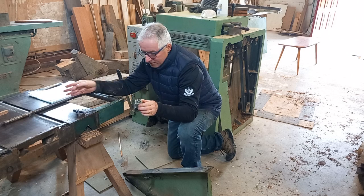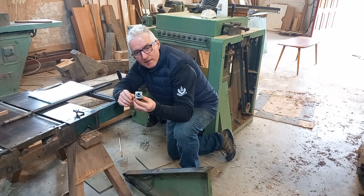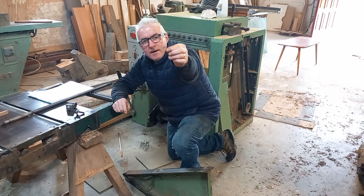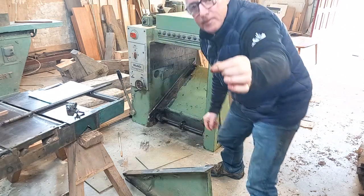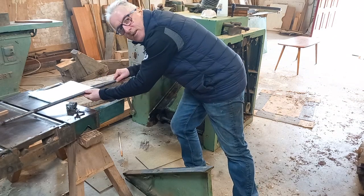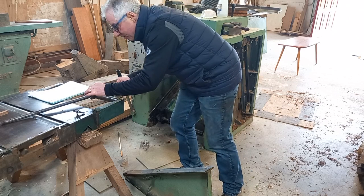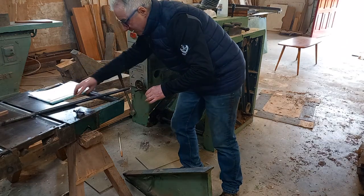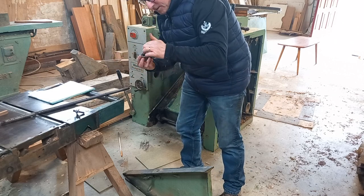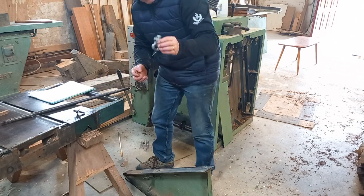In the actual piece connecting the thread to the carriage plate, the thread had completely disintegrated - so much so that some of the thread had actually broken away. As I put it closer to the camera, you can see the thread had broken away and latched itself onto the acme thread itself. This meant that as the bolt was travelling up and down it had to come over its own piece of metal, so it was clogged up top, bottom, and in the centre. Every time the table moved, the thread was disintegrating further - it was completely worn out.